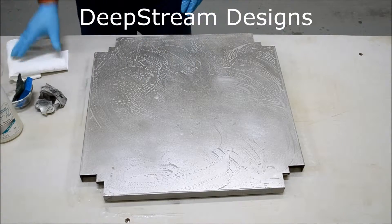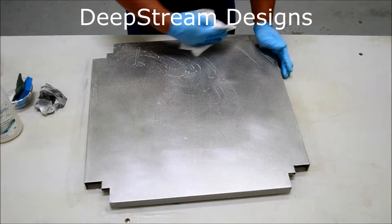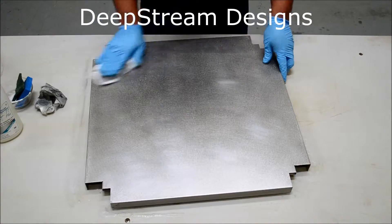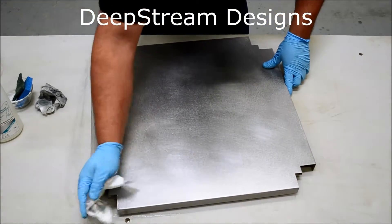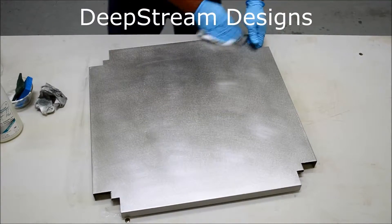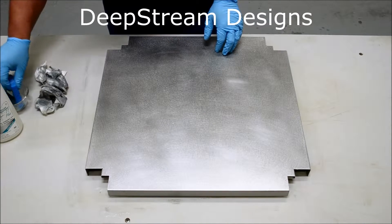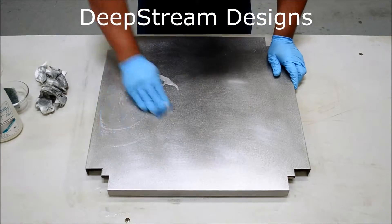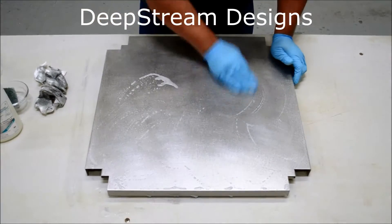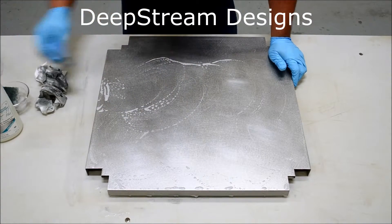Now that you're done with your green scrubby, you'll take a paper towel and just wipe it off. Then all we're going to do is put a fresh solution of the Stellar solution on it. That way we're going to passivate it again for your next six months or so by leaving this clean solution on it for about 20 minutes, then rinse the whole bin off with fresh water as discussed earlier. And that's that.